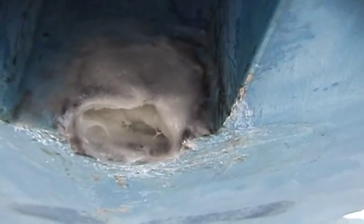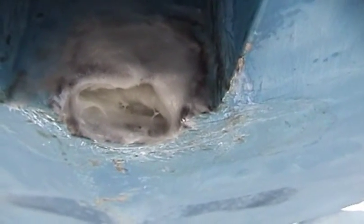So I've been filling it all day. This is the third layer of West System Epoxy. What I've been doing is mixing it up, thickening it with a 404 filler thickener, and cutting up a glass mat into half-inch to three-quarter-inch hairs, mixing it all in and packing it in there. You've got to be careful — you can't put too much at a time because when she kicks and it's too thick, it'll get real hot. I could feel a little warmth right now from the last coat. I've got one more layer to put on and I'm hoping to get that done today. The rest of the keel trunk looks good.